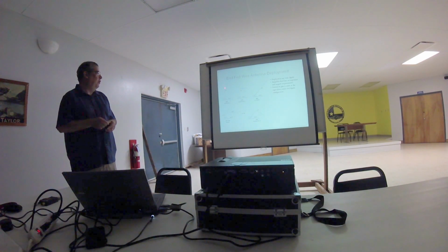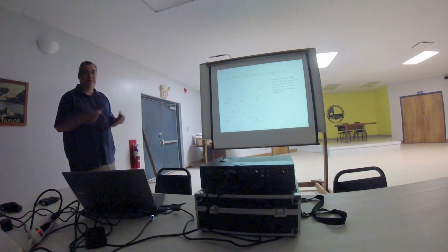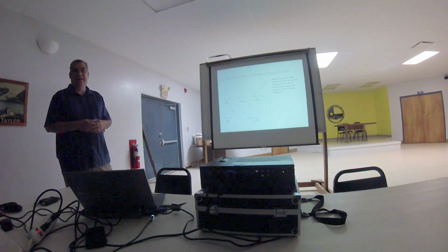If this was, for example, a vertical dipole, somewhere here at about 30 feet, I'm going to have to come out with my feed point, and I'm going to have to bring it out as perpendicular to the radiator as possible for a ways to ensure that I get proper matching. So not only sending the end of the wire up, but also having to support the feed point about 30 feet off the ground starts getting a little onerous.